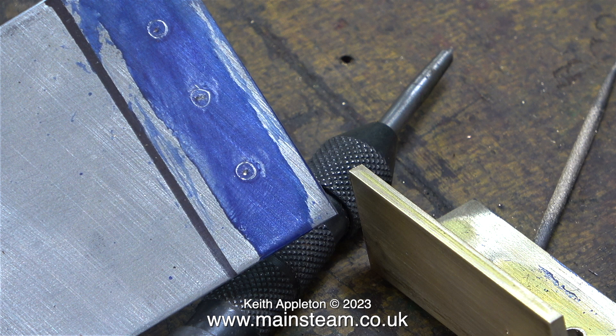The good news is that when using a centre punch you can easily correct the positions of the holes by re-punching with the punch held at a different angle. If you're a beginner to this sort of thing, try it on a scrap piece of metal and you'll see what I mean. On this piece of steel it was really easy to correct the error, and then I drilled the three holes.